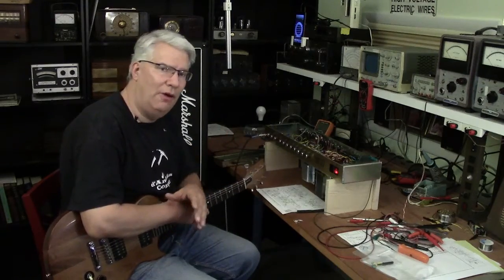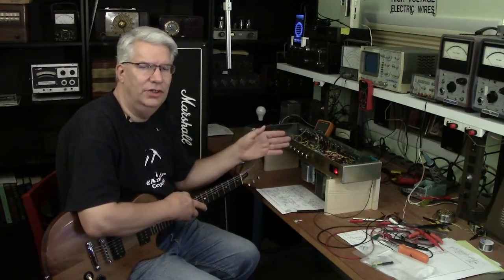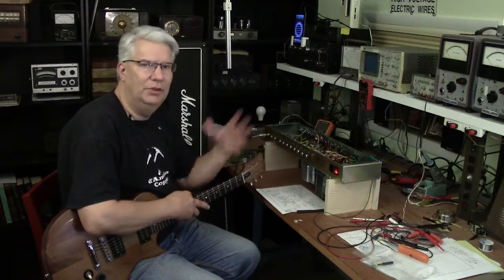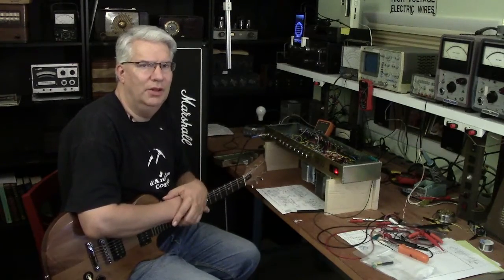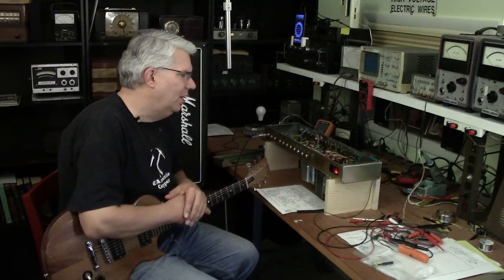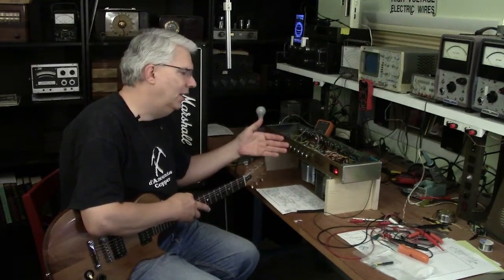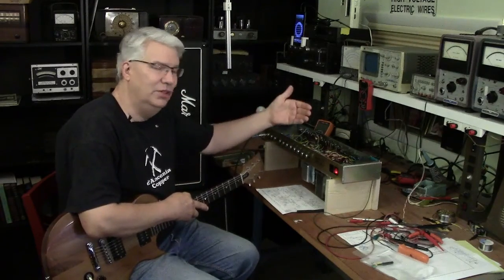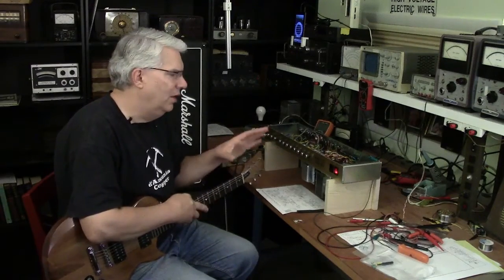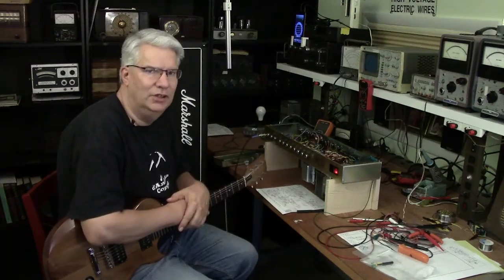We did some plotting of the power output itself, and we integrated that over a cycle. And we found that this amplifier, indeed, at all voltages, if the screen voltage is around 425 volts, at whatever the amplitude is, we're still below the 25 watt limit on the plate dissipation for the EL34. And that's a good thing. So this is a pretty well designed amplifier, and I believe that the engineers just picked the operating point for this amplifier right out of the Mullard data sheet. It seems well suited, and it's an optimized placement for the bias point.